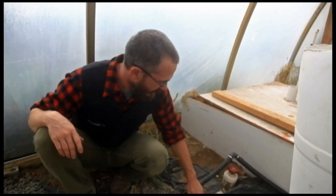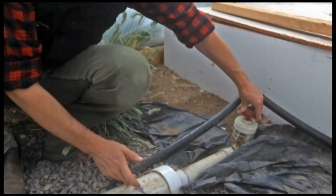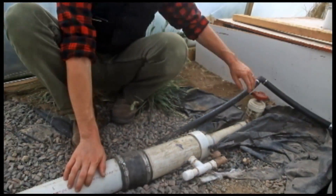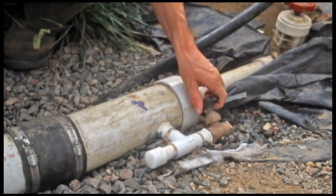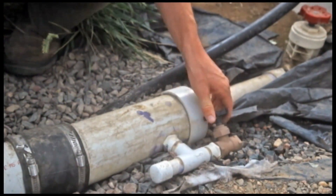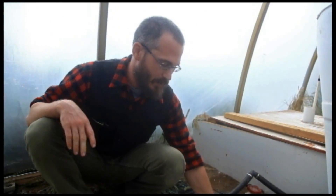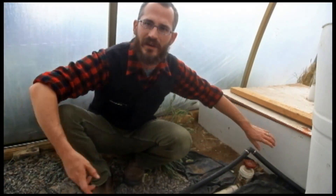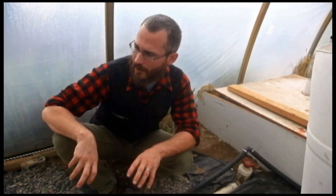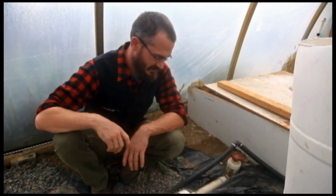It runs down here and we've got two inch pipe that goes through a valve. This allows us to close off the flow from our plants to our sump tank, and by opening this valve it allows us to basically suck water out of our drainage system and send it somewhere else. So if we ever have to spray something we don't want the fish to get, we can hook up a hose here, turn this on, put a little inline pump in, shut this valve, and basically suck all of the return water out of our system. That's a nice little feature that gives us more flexibility with what we spray and use in our greenhouse.